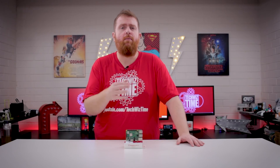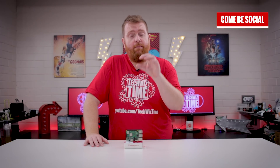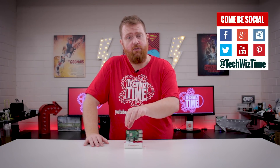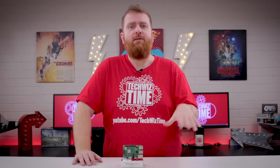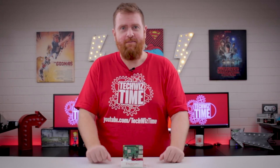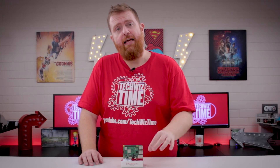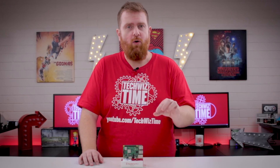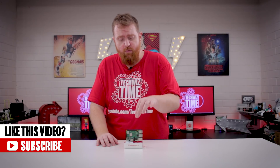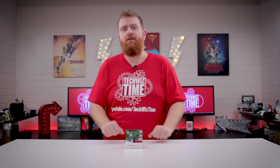This has got a faster CPU by about 200 megahertz — it went from 1.2 to 1.4 gigahertz. The Wi-Fi module has been upgraded and it's also got a shield on there, so if you're putting this in commercial devices you don't need an FCC regulation test to make sure it won't interfere with other devices. It's been upgraded to AC which is 5 gigahertz. The Ethernet has been upgraded to gigabit, however it's not true gigabit, and there are extra pins for PoE, though this device is only PoE ready.